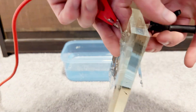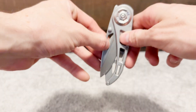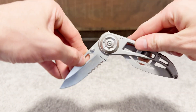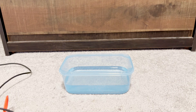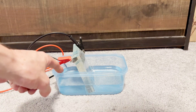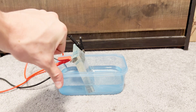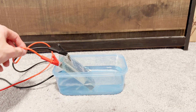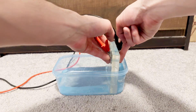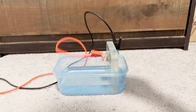So let's just move the cathode and anode plate to be touching the membrane. Now the membrane can't touch water, which is what we need to pass through it, so we can't transfer any of the hydrogen ions. Again, though, this isn't a problem. All we need to do is add some holes into our anode and cathode plates — now the water can touch everything. However, water touching both sides is a little bit redundant and causes potential for the oxygen and hydrogen to mix because of some engineering constraints. But we already have the membrane conducting the current via hydrogen ions connecting the two plates. So realistically, we only need water on one side — in this case, the anode, since that's where the hydrogen ions form and they'll be able to cross over to the other side selectively.